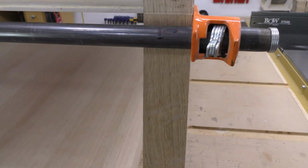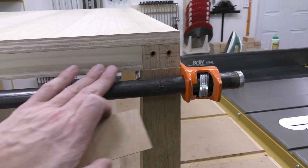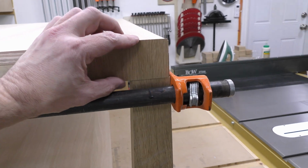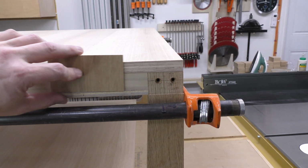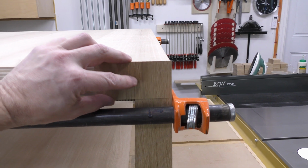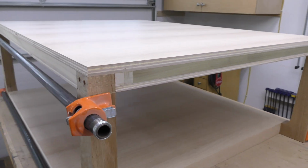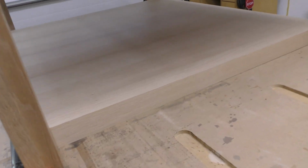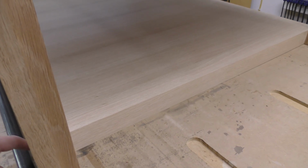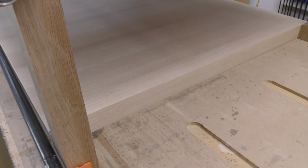And what's going to end up happening, as I was making before the veneers, is that all of this edge and this will be covered by the vertical grain veneers that I was making. So it'll look like all one piece going across, as if the top sits on top of the leg. And this side will get horizontal edge banding, just like the bottom here. I already went ahead and did that just because the legs have to mount to that face.